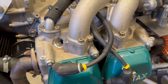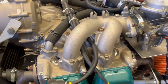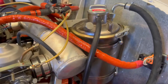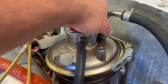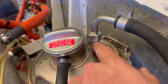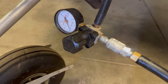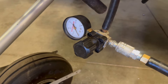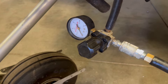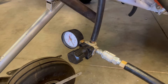We have all four of our top spark plugs removed so that we can turn the engine over easily by hand. We've capped off the tank, we've made sure that the feed fitting that goes out of the tank is nice and tight, and we've connected our regulator that we're going to set for 10 psi. I usually use 10 — they say not to exceed 14.5 psi, and I don't think 5 is quite enough, so 10 is right in the middle.